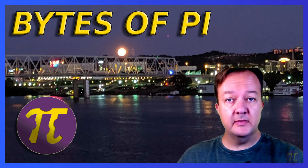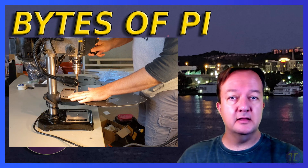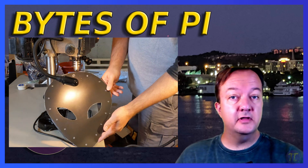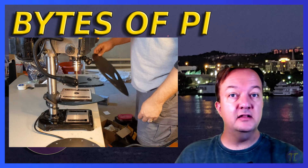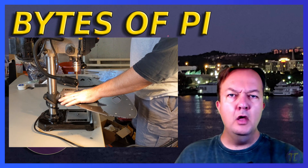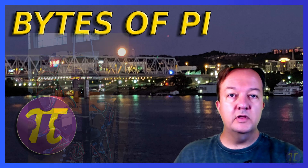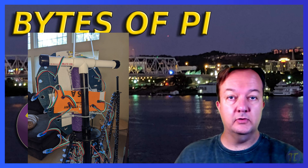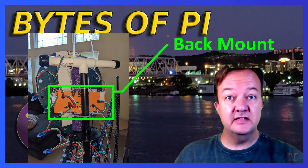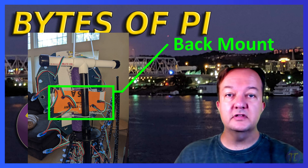At this point the trees were complete, but Halloween is coming up. We don't necessarily want Christmas trees in the Halloween show, so my wife came up with the idea of taking the 20 pixels used for the star and rearranging them to fit some sort of alien head. While the outline of the head could be done in pixels, we wanted a waterproof material to diffuse the light so that two pixels behind it would look like one big eye. We tried a few materials and found that a cheap white shower liner from Walmart did the job — it diffused the light from two pixels enough to look like a single glowing eye. We also found we couldn't attach the topper directly onto the tree; we needed space for the alien eyes to diffuse and for the pixels to pass through the plastic without going through the PVC. We landed on a T-formation at the top, which provided stability to prevent the topper from twisting in the wind and gave a good anchoring point to zip tie the topper. We also used a pool noodle to provide extra space between the frame and the topper. For the alien heads, two pixels needed to be positioned far enough behind the eye for the light to diffuse, so we used a corrugated rectangle with holes positioned far enough back to allow the eyes to light up properly.